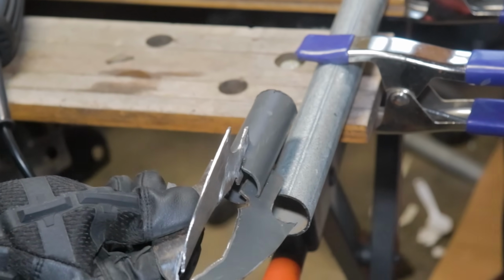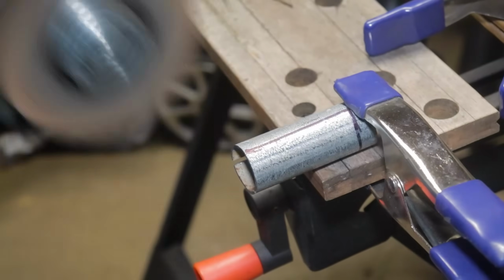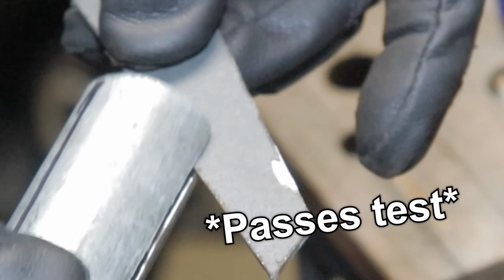So once I was able to fit all 3 of the claws into pipe A, it was time to trace out pipe B. And I'd still have to maintain the equidistant thirds, but I would have to cut much deeper into pipe B. And every now and then I would do a gauge thickness test to make sure that the claw could go in between the parts with ease.